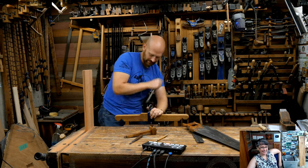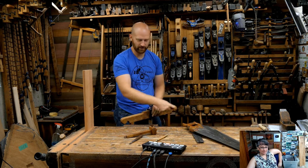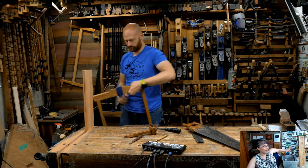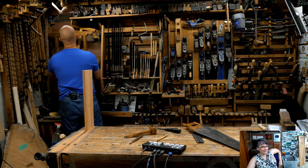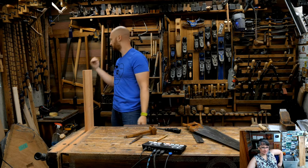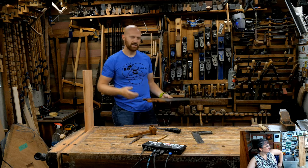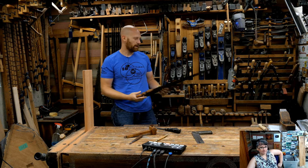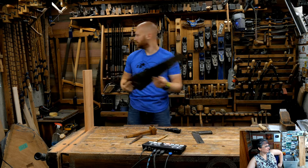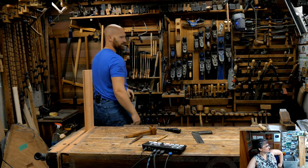Keep going. And when you're done, always take the pressure off of the saw. That way you're not always under pressure. In my opinion, for resawing, that is way easier because I have tried resawing with a handsaw. Because you're spreading the workload out over your whole body, it takes less effort, and you can do that a lot longer than you can do this until you've built up the stamina in that one arm. It's not about the force and the strength, it's about the stamina. You don't need force to push the saw. You need the stamina to just keep it going. Well, a little force helps too. Well, yes. You need the minimum amount to keep it going.